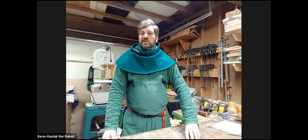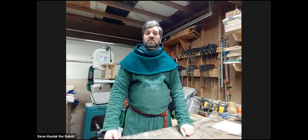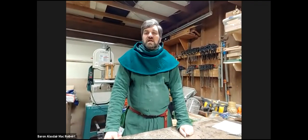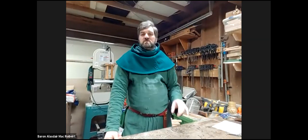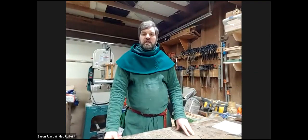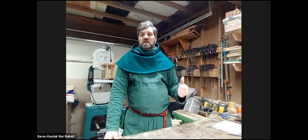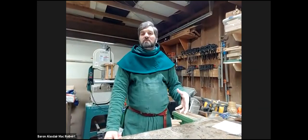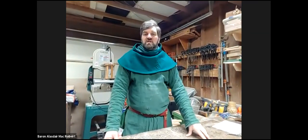Mine are a tiny bit wider than that because I don't want that plywood edge to show. I'll usually use a strip of hardwood — usually oak — about a half-inch by quarter-inch, and use that to go all the way around the edges. It protects the plywood from getting banged around and splintering, and it also hides that plywood edge so it looks like a thicker, stiffer top. It also adds a little bit more rigidity and strength.